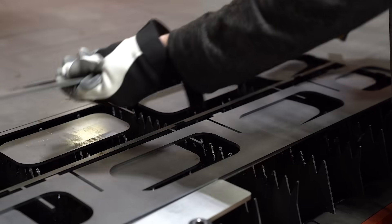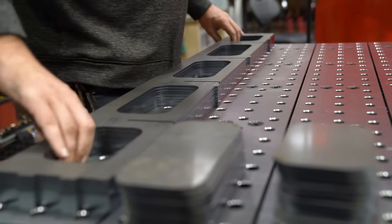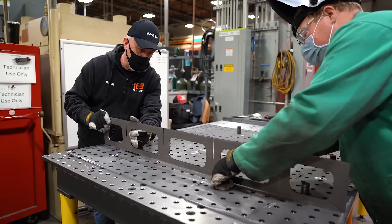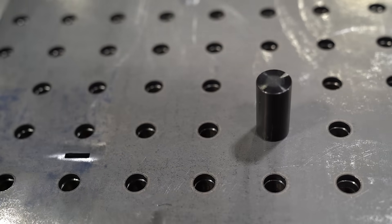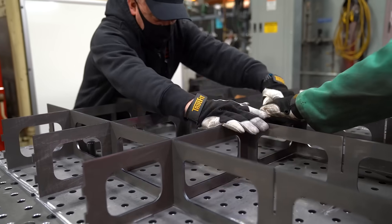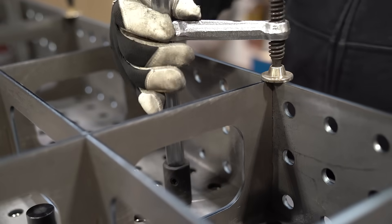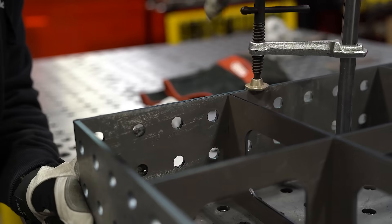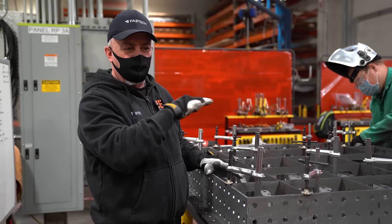The next step is gonna be to take them over to our weld fabrication area and Jody's gonna start welding up this table. Jody's one of our metalsmiths here at First Build and he's actually gonna be doing all the welding on the table. This table is gonna serve as our flatness reference, so we're gonna set our table on top of this table. We're gonna build it upside down so that we know that the tabletop is going to be flat. We've deployed a whole lot of hold-down clamps and all these cross members fit together and will hold the top surface of this table completely flat.